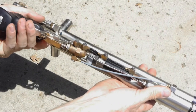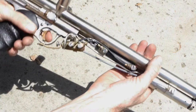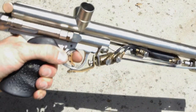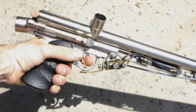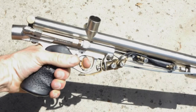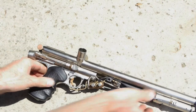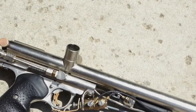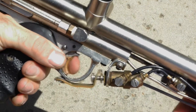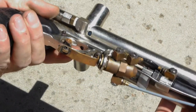And the switch configuration on this one is unique — there's no other Palmer-built guns that use this. Yeah, that's the only one done with that switch configuration that I know of. There was a piece actually fastened onto the trigger shoe and then it runs through the slot in the frame to actuate it. And you said originally it was stainless wire? Yeah, he originally had a piece of stainless wire actuating it, and then when we redid it we did it with a piece of brass.